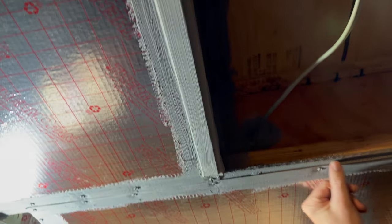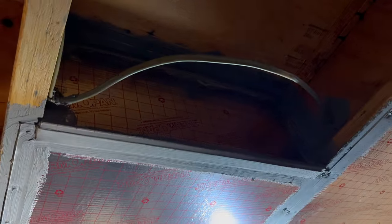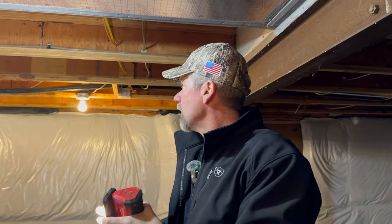This is called thermal pan — it's essentially cardboard. A lot of people ask why you'd put cardboard on your floors. In new construction it can be risky because it can get wet, but in an existing built home we love thermal pan because it's quiet. With metal panning you can still get flex and popping sounds. With thermal pan you get no sounds — no walking on the floor, no worrying. As long as it doesn't get wet, and we use S-lock to make it rigid and seal everything to the floor, it creates very quiet sealed headers.